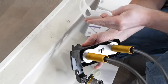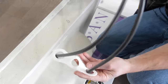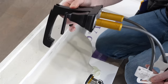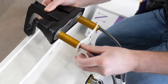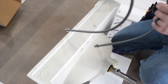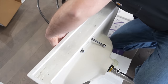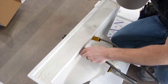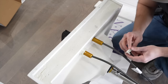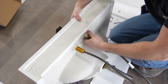I'm now going to take the faucet with the gasket it came with, fish the gasket onto the faucet, and once up at the actual faucet body it goes right around the brass fittings. With the gasket on, I'll fish the water lines into the holes for the water lines. Then I'll take the wing nuts, fish them over the water lines — one for each side — and hand tighten them fairly tight.